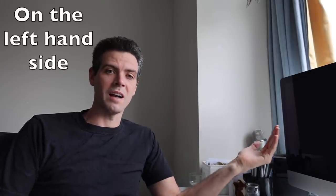I need to do a really quick intermission here because I actually made a mistake. If I wanted to make this better, what I should have done is pull that whole board off and shimmed every single stud — that would have actually straightened the wall out properly. Sometimes when you're in the middle of a task and just trying to get through it, that answer doesn't always come to you. It came to me a couple days later. We all make mistakes, and yeah, that wall is boarded, taped, and first coated. The good news is there's going to be a stove right there breaking up where most of that hump is, with lower cabinets on either side, so it shouldn't be a problem.